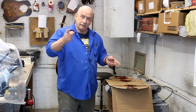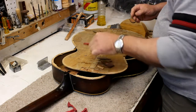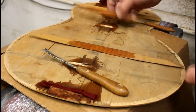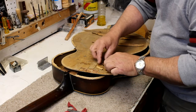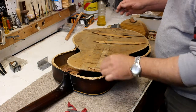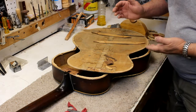That worked exceptionally well. After soaking these things with rags for the whole day yesterday, I used a little palette knife under there and these braces popped right off. As a bonus, these very delicate pieces of mahogany that come from the head block and the tail block, which I thought would surely be lost, they just eased right off, and I think I can slip those back down into the guitar and just re-glue them. Also, this very delicate piece of kerfing came off, and I've got three or four places on the back that I'm going to soak today to see if I can save that kerfing as well.